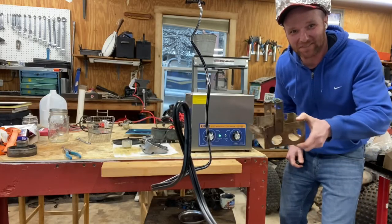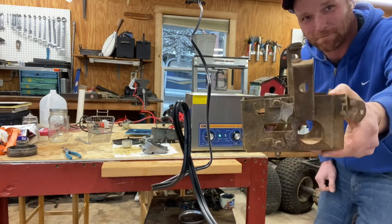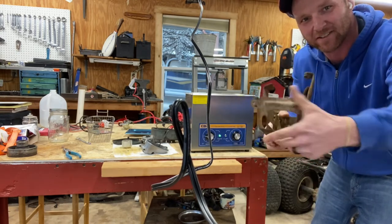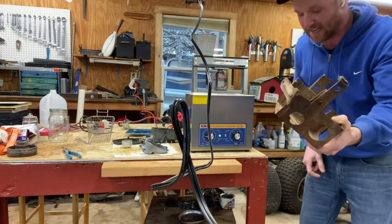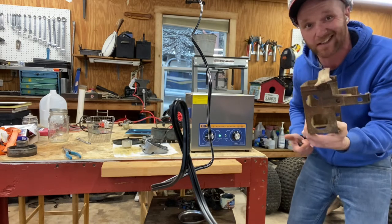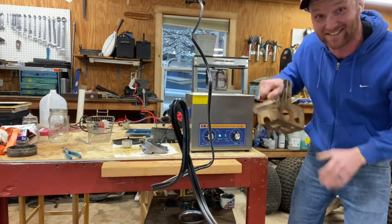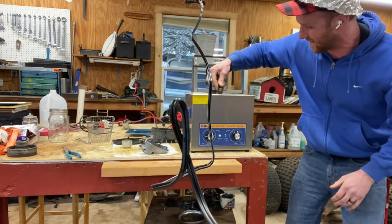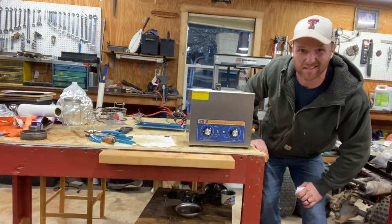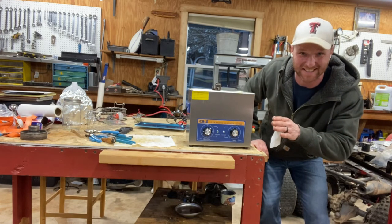All right gang, we're going to do a little bonus episode. What I found here is the rustiest part I could find in my whole shop — it's a battery box out of a 1985 Honda 250 ES three-wheeler, the coolest machine ever made. We'll do a video on it. I've got the Evapo-Rust cranked up to 175 degrees and we're going to run it for 30 minutes and just see what happens. I don't think it's going to clean it completely, but with the boiling Evapo-Rust steaming up I think it might do it. Let's see what happens — I'm just going to shove her in there and crank her.